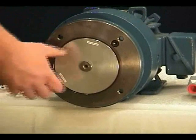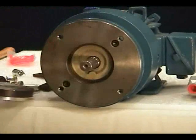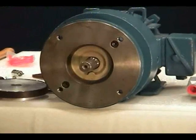With a through shaft style rotor, you loosen the set or cam screws holding the rotor to the shaft. While set screws will disengage with a number of turns, cam screws disengage with less than a single turn. Now remove the rotor by hand, taking care not to damage the outer magnetized ring.